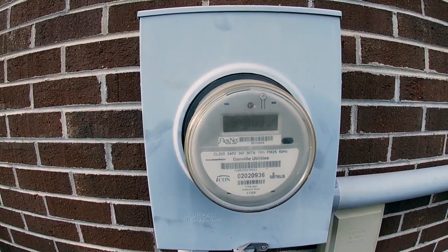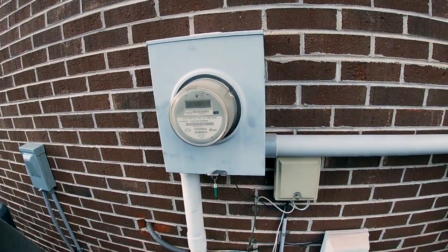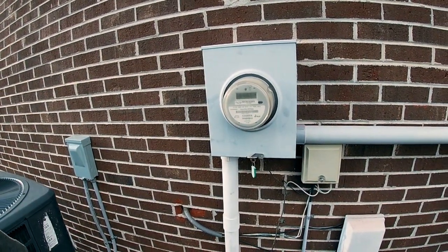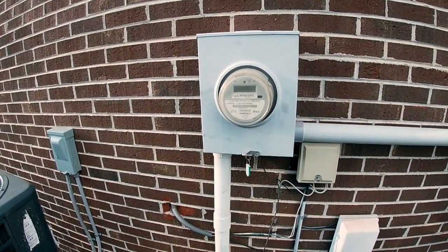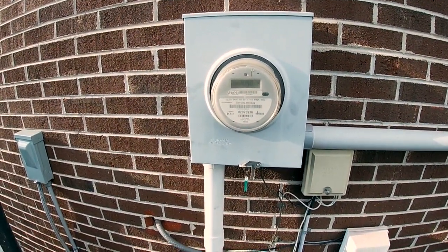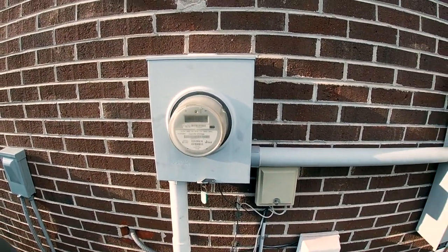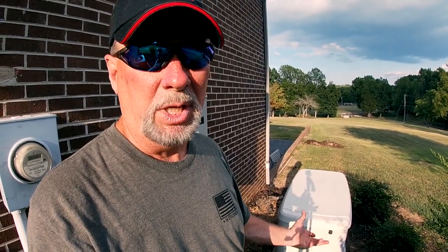So that's basically 20 kW. You just need a generator that's bigger than that — it's that simple. So when you go to your meter, you can look for that number to come by. On my house, our peak demand is over 29 kW, so the generator we have on order is a 31 or 32 kW. At Dad's house, we installed a 24 kW. So if you're even thinking about getting a Generac for your home and you don't know where to start, this is the place to start.